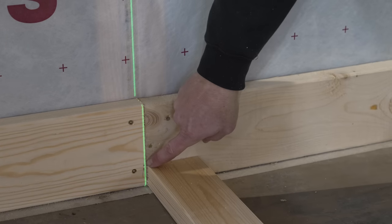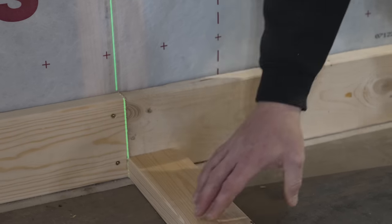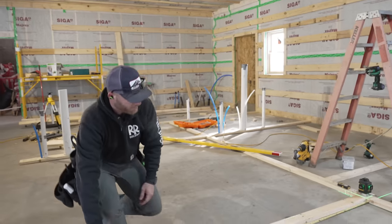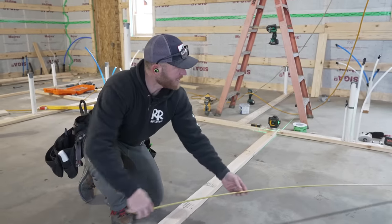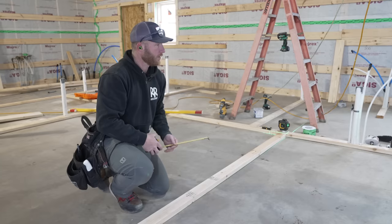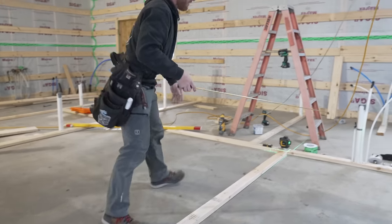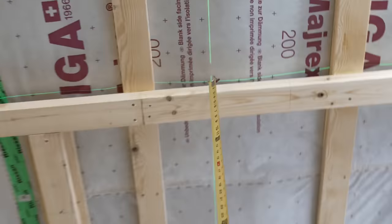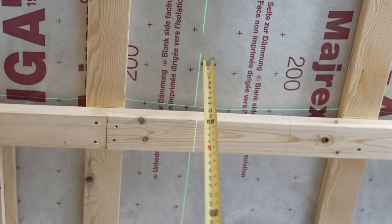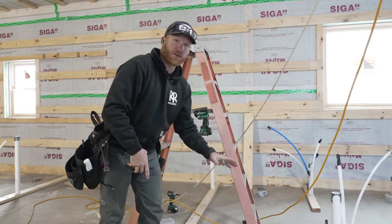Look at that — I marked this out from the corner just to get an idea where I'm going, and we're running pretty square because that's right where my laser is. Traditionally you might use a 3-4-5 triangle, make a couple marks, hold a diagonal — kind of a two-man job and can be a little inaccurate. This guy right here — easy as just stealing candy from a baby. Now I've got my square line at the top — that's where my wall plate is going to go on the ceiling. Good investment if you want to build accurate.